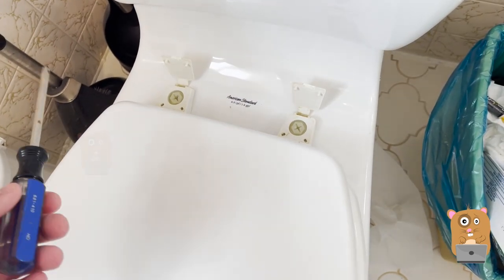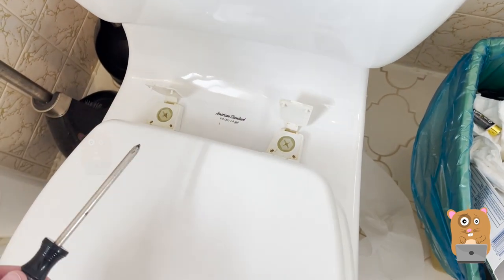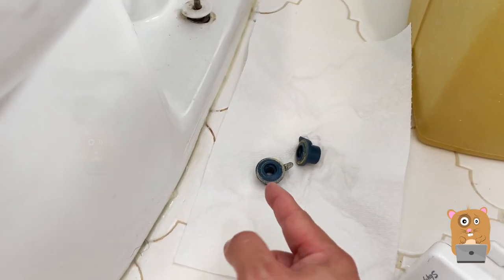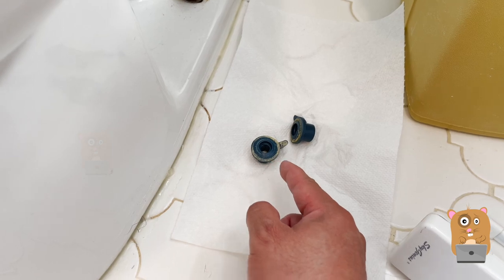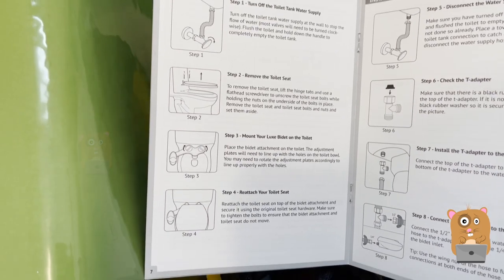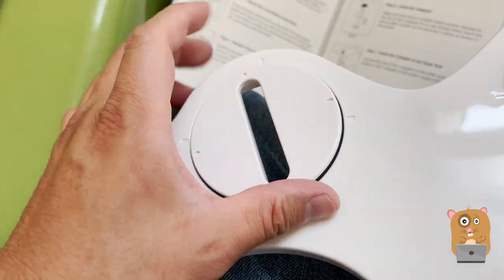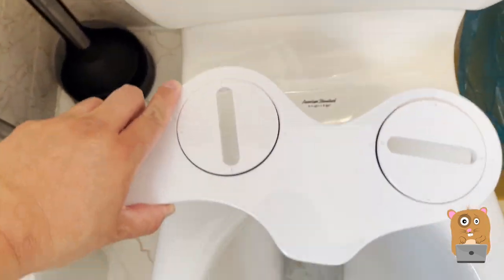I'm not ready to make an installation video since I'll need both hands for it. But to remove the old toilet seat, pop off the tab. For standard toilet seats, take a Phillips screwdriver and unscrew it. This piece is below the toilet seat — you may need to hold the screwdriver in one hand and use the other hand to hold the bottom piece in place so it doesn't keep spinning. The water's been shut off and I've removed the toilet seat. Now it's time to mount it. I'll place these tabs on temporarily because, as the instructions say, I'll need to rotate it to line up with the hose.